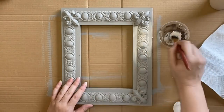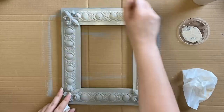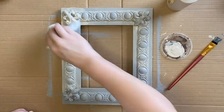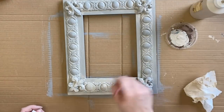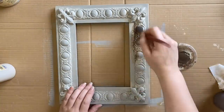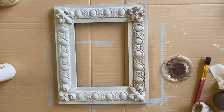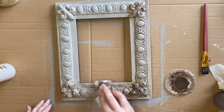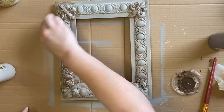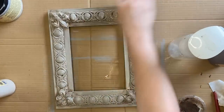I first used Dixie Bell's All Natural Voodoo Gel Stain, using a wet wipe to wipe back the excess so the color sits in the details — we're going for a weathered and worn layered effect. When that layer was dry, I grabbed Dixie Bell's Tobacco Road Voodoo Gel Stain, laying it on and then wiping it back. I'm loving how these two colors work together. You could achieve a similar look with waxes or glaze if you don't have these products. In some areas I used my water mister to remove even more product.